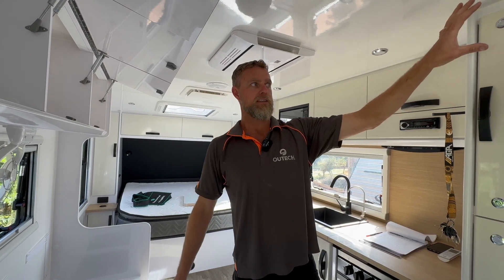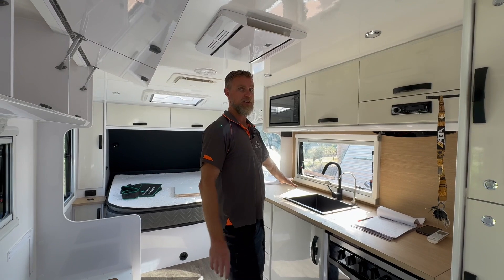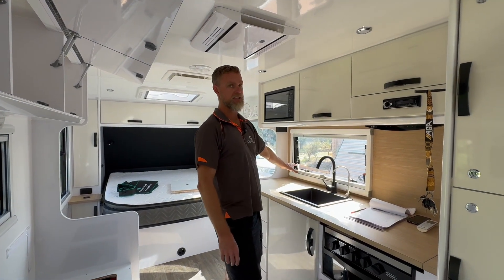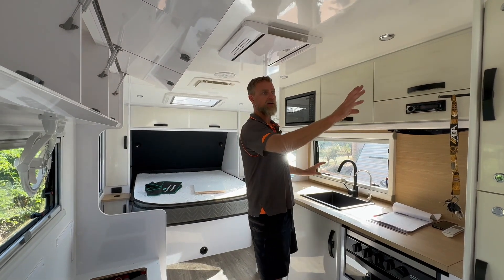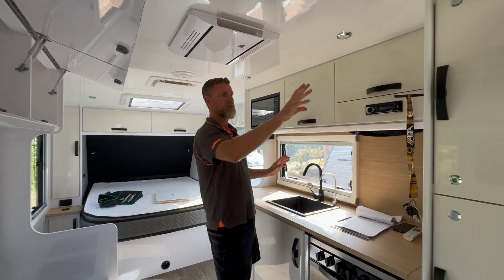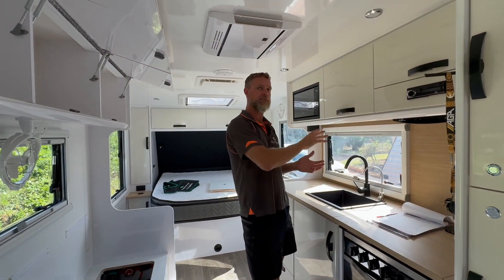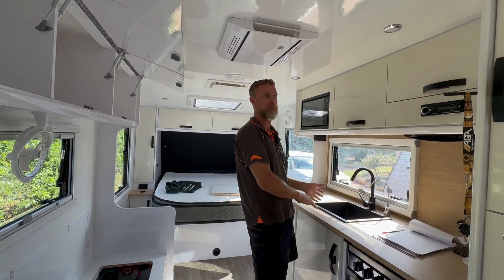With the charger being so far away from the batteries — and if you think about it, it's not that much further from where the batteries were originally — what can happen is that if you don't put the appropriate amount of copper in, the charger will actually think the batteries are full before they are, so they don't actually charge the batteries appropriately.